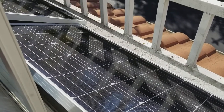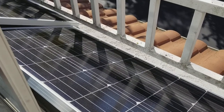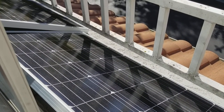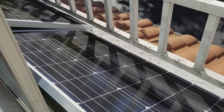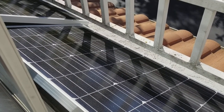You can see I've got it set up here — it's in sun and partial shade. But if you put it in full sun, this will generally put out about five amps measuring on a multimeter. So it's fairly close to its rated voltage and rated wattage — at the higher panel voltage of about 18 volts — when you do have it in full sun.